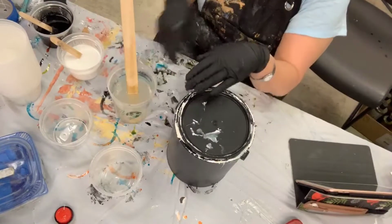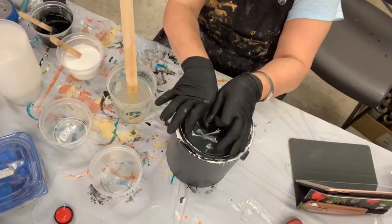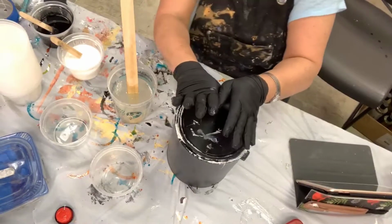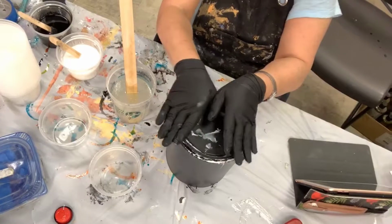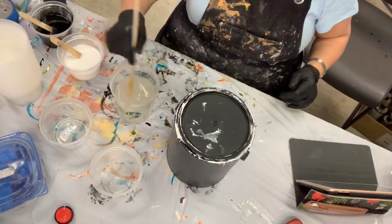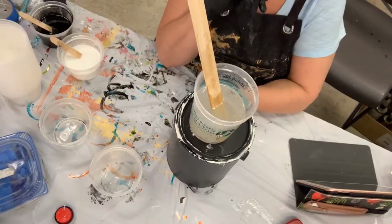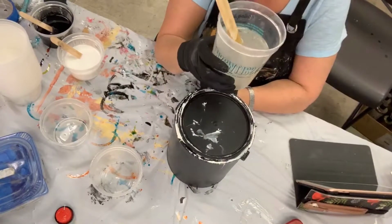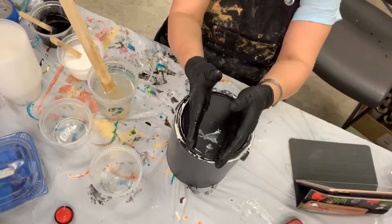It's designed to self-level completely. You're getting much thicker millage once this finally dries, and it's super, super glossy. When you're using countertop and flooring epoxy, the leveling is very important. You get a nice level surface. It scuffs easier, but in 90% of cases, I'd say epoxies are harder wearing than polyurethanes. But it all depends on what the job is.